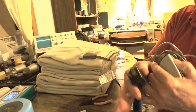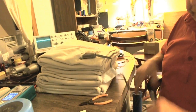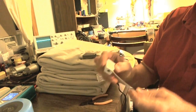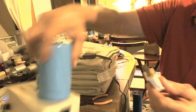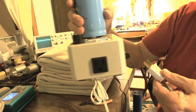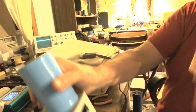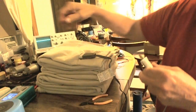But we're not going to do that for this video because I don't have a lot of time — it seems like I've got five minutes on here already. We're just going to put these two together. This will plug into the frequency converter right here and we'll be able to control the heat blanket with the spooky running different frequencies and different intensities. This pot right here can be used as a heat adjustment, or you can use the spooky and change the heat adjustment by changing the duty cycle of the wave pattern you're feeding into here.